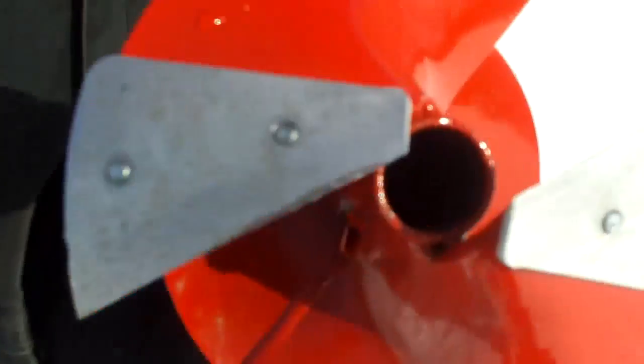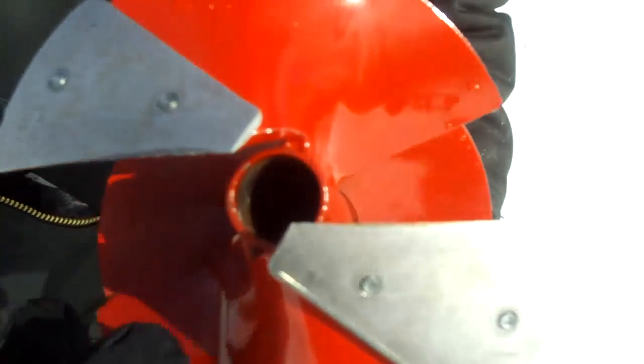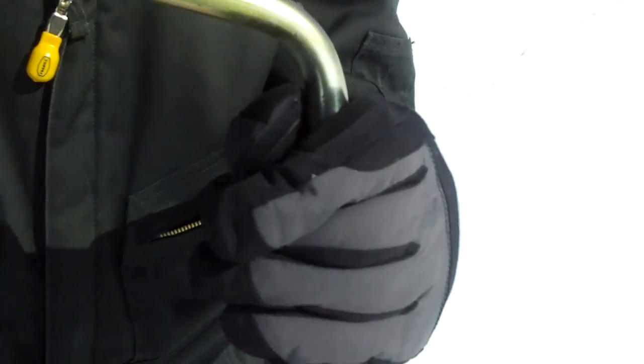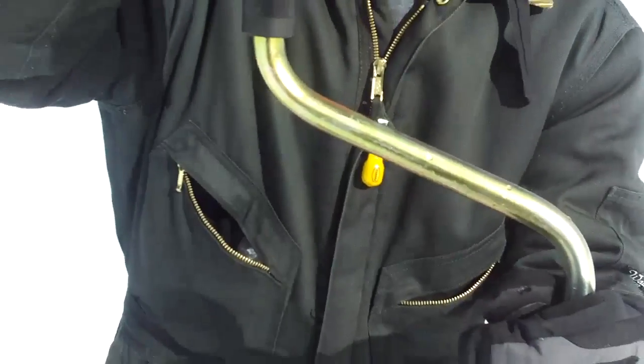You can see there's a big difference in the blades. These blades here are actually screwed onto the drill portion of the auger — you can see on the back here where the bolts are. And I want you to see the handle. On this handle you have a mushroom style top handle. What you do with this auger is apply light pressure with the right hand, hold it with the left hand, and this is where you turn it — keeping the right hand stationary at all times.